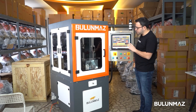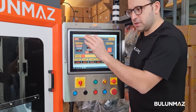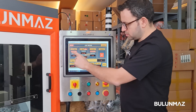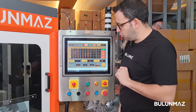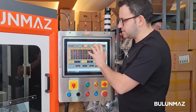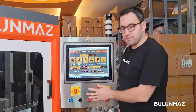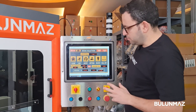Here is the job screen where you make all settings and set the zero point of your machine. Once you know which millimeter ball you'll use, you set the zero at the point where the tool touches the ball. Then you go to Auto mode, choose from the database or make a combination, and set the design — how many cuts, how many passes from left to right. All settings are done and you start the machine.